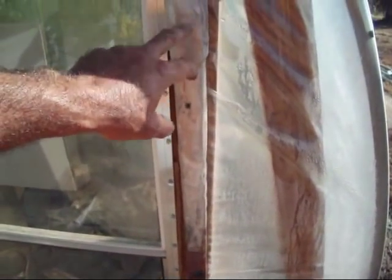This is day two of trying to get my second layer of plastic on this first greenhouse. What I'm doing is pulling my screws out and the one by two furring strips that I've got securing the plastic. Then I'll unroll it and put my aluminum channel down behind it, pull the plastic tight, and put the wiggle wire in like I did on my little hoop house I built over the woodshed. It's a little bit slower process than I anticipated, so I didn't get as much done yesterday as I had hoped. But I did get the other end done and switched out the north wall.